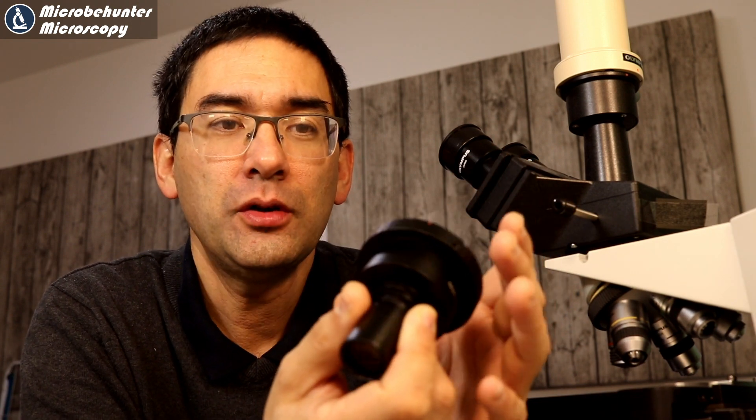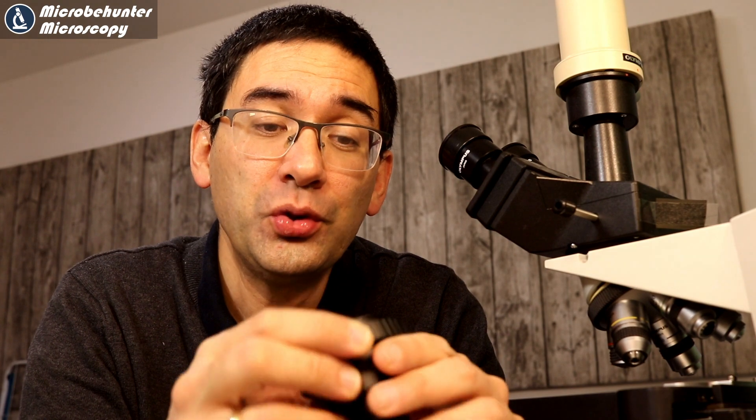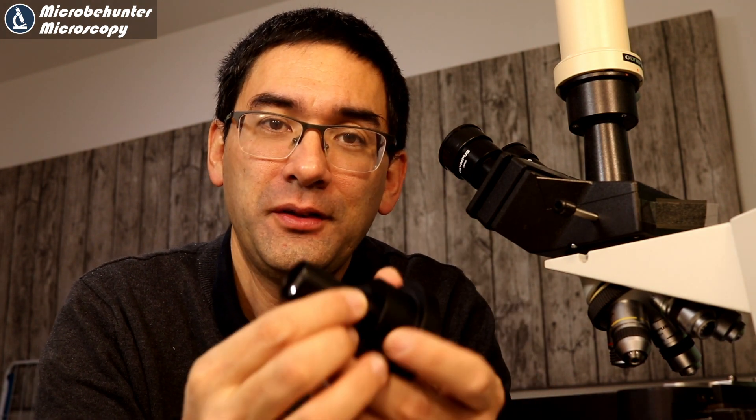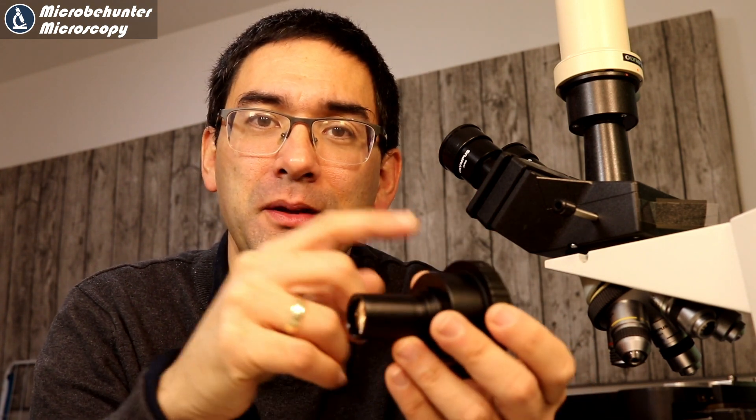I was concerned that maybe it's the optical system inside my microscope that's responsible, so I changed things and put it in instead of one of the eyepieces — but the image quality still was bad. For whatever reason, the optics of my stereo microscope and this adapter somehow don't seem to work together to the extent I was hoping. It's strange. When I put it into my compound microscope, the image quality was generally fine, with the exception of the corners at 4x magnification. What this shows me is that it doesn't only depend on the optical quality of the adapter itself, but also on how well the optics of this adapter work together with the optics of the microscope.